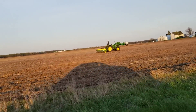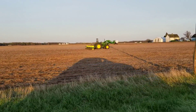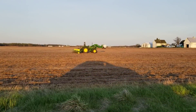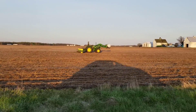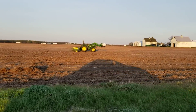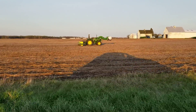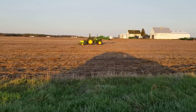The first 10 acres has been quite a challenge. Bad fertilizer pump, bad closing wheels, not enough weight — but I knew that one and I had plenty of bars. I now have six bars crammed into the frame and it seems to be working all right. I've got about 98 pounds of margin on the downforce. Took me a while to open the field; I had a row that kept plugging. Finally got it straightened out and it seems to be doing well now.